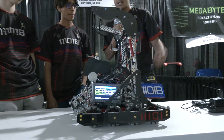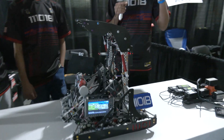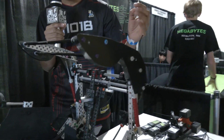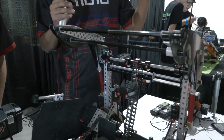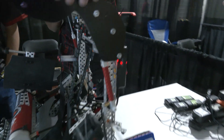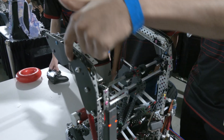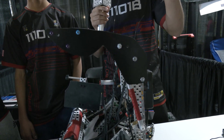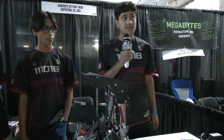Now for the climb — this climb is essentially a big impulse and momentum problem. We're going into the climb at different speeds, so we really had to tune the different shapes of these sleds. This is actually the fifth or sixth sled we went through. This shape is made perfect so Alex can drive at various speeds — not too slow, not too fast — and hit it successfully in most matches. We use Delrin and polycarbonate, braced all the way across for full reliability and stability during the climbing period. And this cutout is the exact same shape as that triangular climb pole — we traced it out and used our calculations for the sled shape.